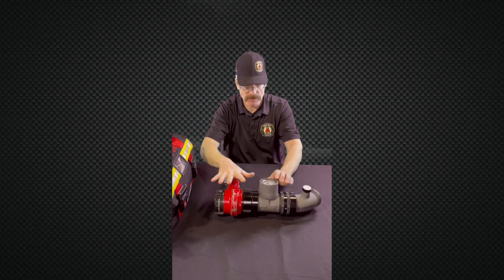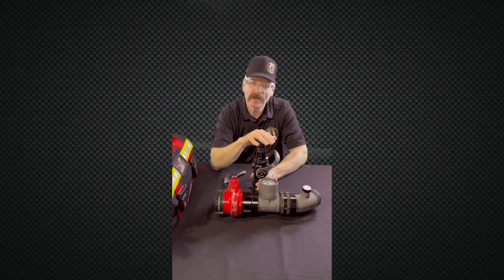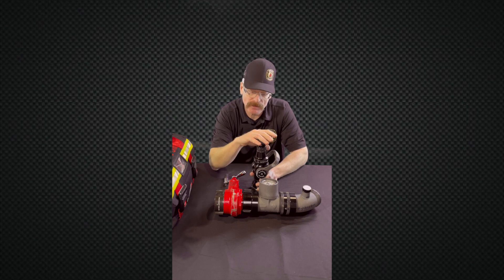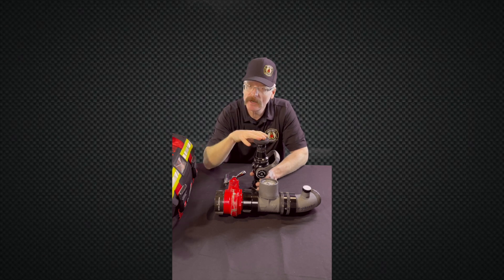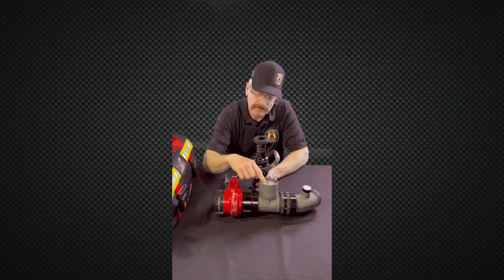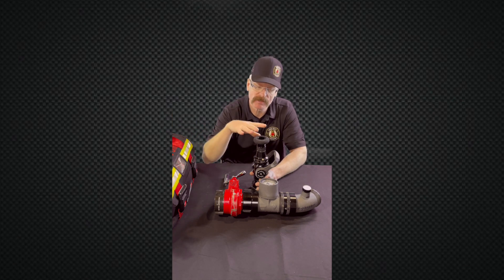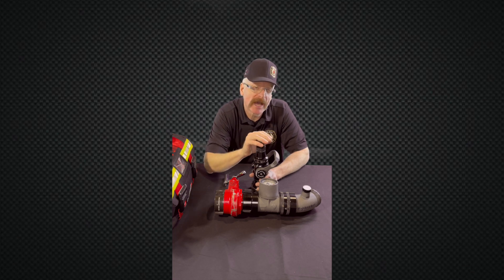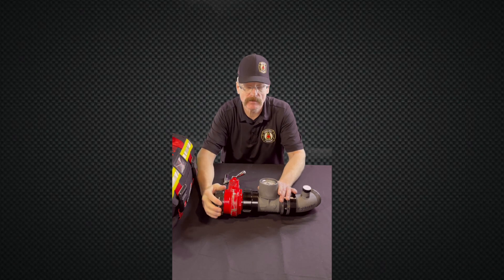I do talk about nozzles — it's sitting right here beside me. When we look at nozzles, we're going in with a big punch right off the get-go, the full potential. That's why I don't like stacked tips — on a stacked tip you're going with a small tip and eventually getting to your bigger tip, but I want to punch that fire out as soon as possible. If I don't have reach or stream because of low pressure, I can switch tip sizes and go with a smaller orifice, but just be aware you don't have the same flow. I like to go in with the big guns, proper flows, and get that fire knocked down to prevent smoke from spreading.